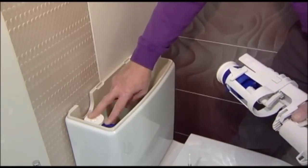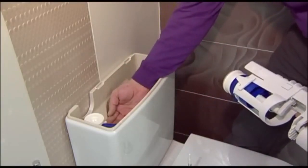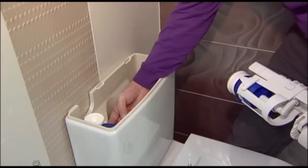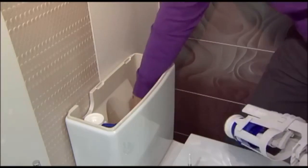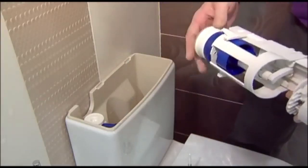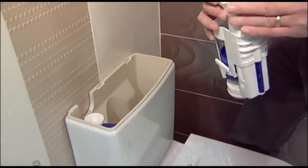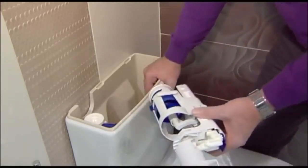and that's the element that would need replacing. If the water level is low, beneath this point, and it's still letting by into the toilet, then you're pretty sure that it's the flushing valve that's at fault, and there could be a number of reasons why this mechanism would fail to seal and let by into the toilet.